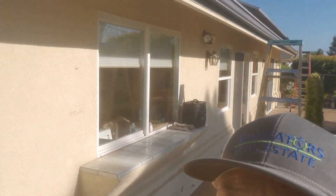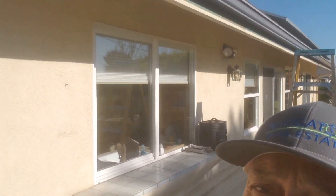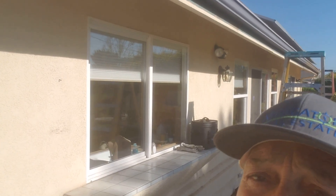Hi, it's Royce Eddings, Royce Construction. We're going to show you how to put together a patio cover. There's an existing rain gutter that runs the full length of the building. We just removed the old patio cover — you can see the metal post base holders in the ground. We have a two by eight fascia board and the rain gutter is covering all but about three and a half inches of it. The original rafters were only two by fours, so they fit perfectly underneath that gutter. Now we're using a heavier roof — we'll need two by sixes with two by six tongue and groove above that, so we need seven inches plus room to get flashing up underneath the flashing coming off the roof.